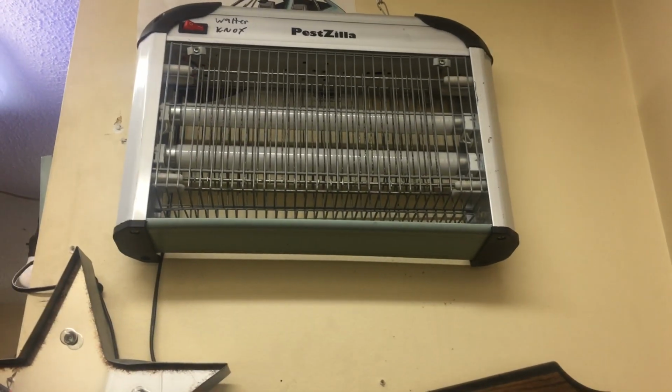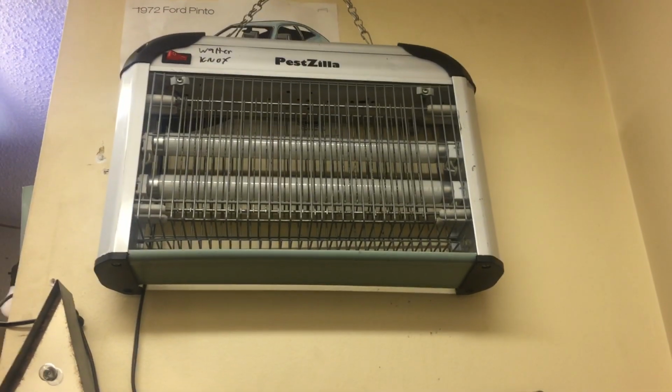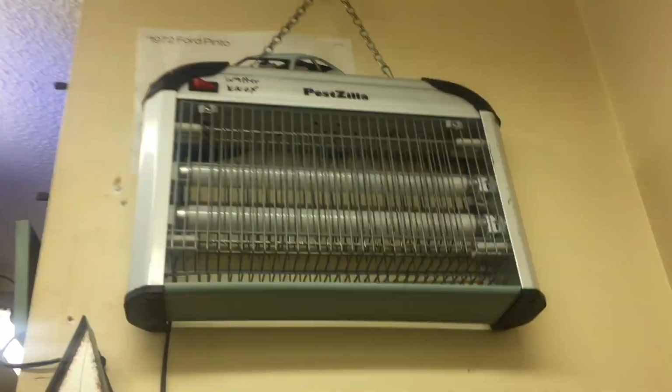Anyway, the little CFL ballast died, so I went through a couple of different ideas here. And here's one of the lamps that came out of it in case you're wondering. Yeah, I fried one, and then the other one fried itself, but anyway, I have quite a few different fluorescent ballasts, and my first idea was to take a couple of these choke ballasts that drive 15-watt lamps and put starter switches and stuff in there, but that ended up being messy and didn't work.